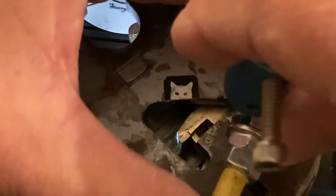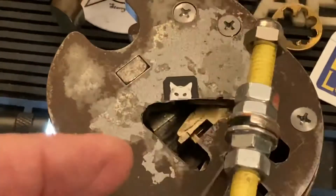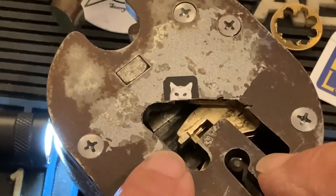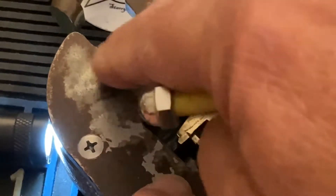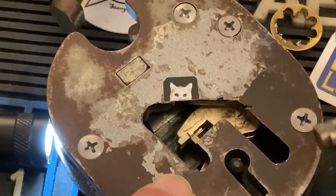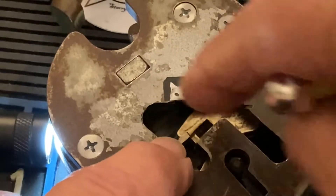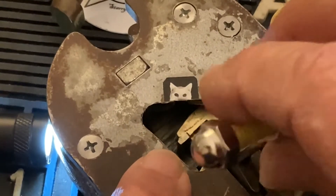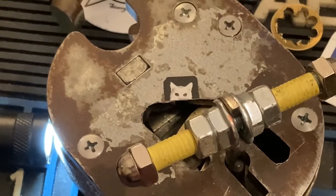I fashioned this one after Brummy, who did a Chubb cutaway. These little cutout notches were basically what I could figure out from what he did. A lot of times when you cut away a lever lock, it does not function and does not pick as it used to, but this amount of cutaway here, and the positions of the cutaway, make this one pick just the same. I was glad it turned out that way.